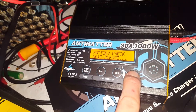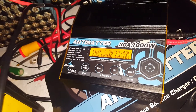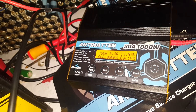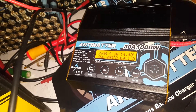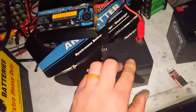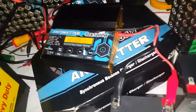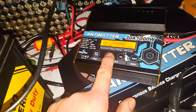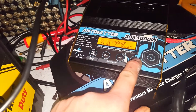I'll just make sure this battery is charged first. It's pretty close — sitting at 13 volts static by itself. Current's dropping back off straight away, so it must be pretty close to charged. It's a 12 volt 5 amp hour sealed lead acid. We'll call it charged enough for the sake of this.